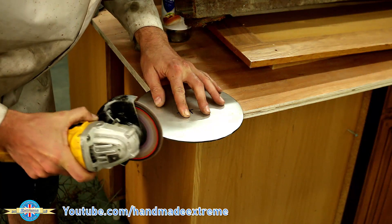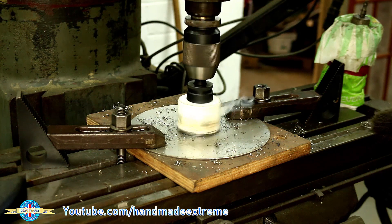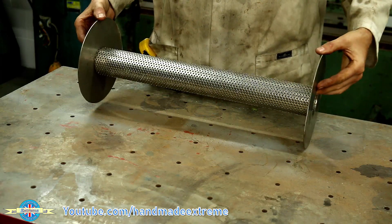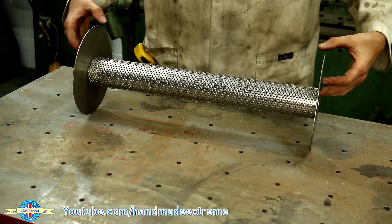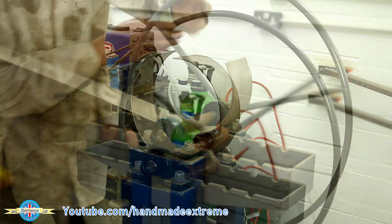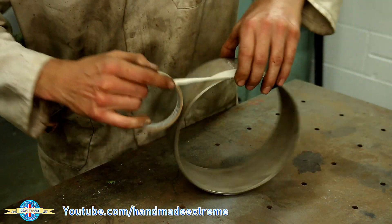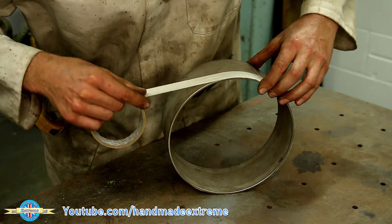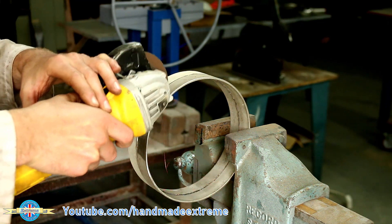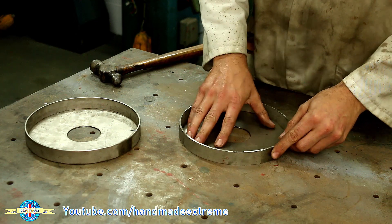The end caps can be cut out on the bench, cleaned up with the grinder, and then I can cut the hole out in the centre on the Bridgeport for the pipe. They're going to go on the end of the perforated pipe, and I need to make some hoops to go around the outside to attach the outer skin. I can roll those up on the ring roller — I made that in another video — then weld them together. Using masking tape to create a strip the right width, I cut that out with the grinder and I'm going to TIG weld those up.